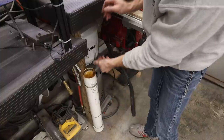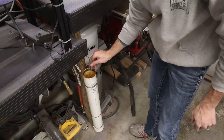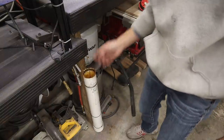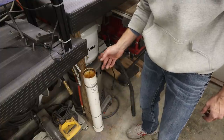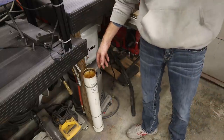We're just gonna take this, give it a swirl in there, make sure it's all mixed up. And I also swirl it because sometimes it can knock debris off of the blade so you get a more even etch. The other thing that I do is I pull it out of this etchant really fast. The first time I only do about 10 or 15 seconds, then I pull it out, and I lightly go over it with 4-aught steel wool to kind of clean off the surface.